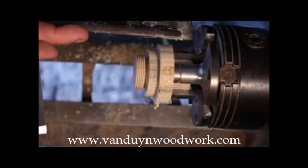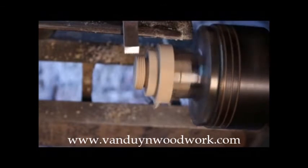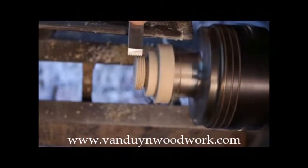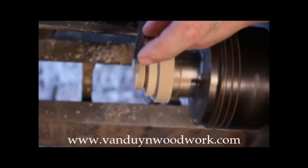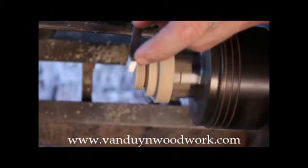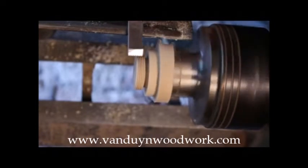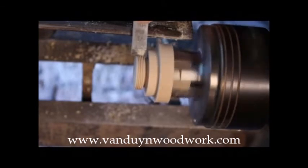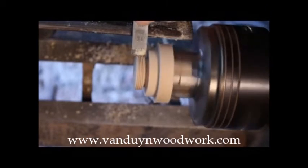You're going to let the tool do most of the work here. This isn't a lot of force — all you're really doing is guiding and the tool's going to cut itself, so it's kind of a low-pressure operation. At this point I'll start here, and you'll see that the tool is kind of moving itself. I'm riding on these bottom portions right here and not actually doing the cutting — that's how you're going to want to start off. This is what I meant by having the tip of your teeth up until you engage the threads, and then slowly work it down. And you're going to take very light passes.